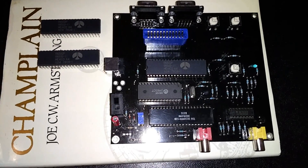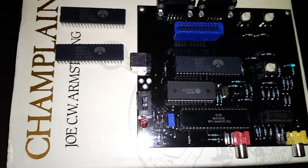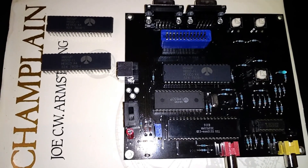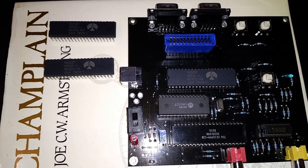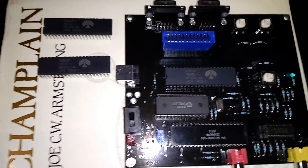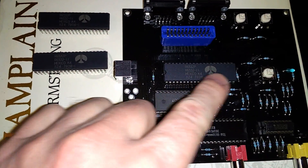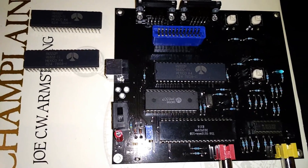I've had some setbacks with the RIOT chip. This original RIOT chip that I put in mostly worked, however I was not able to use the joystick to move right — it didn't recognize joystick input to the right. So I ordered two replacement RIOTs. The first replacement overheated and didn't work at all, and the second replacement — the third RIOT altogether — doesn't overheat, but video doesn't display or anything.